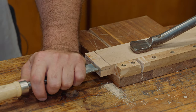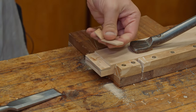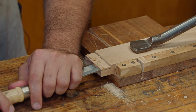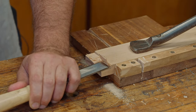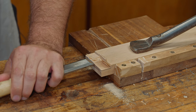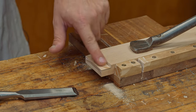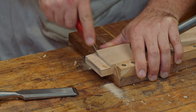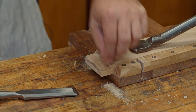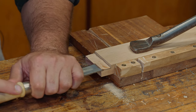We can see that it is splitting out quite straight. So we can come down and take out a little bit more. Now I'm going to go down and come in 1 or 2 millimetres just above that marking gauge line, and work across once again. Important thing is that we don't go below that baseline. I can see I haven't quite cut deep enough, so I'm just going to bring my marking knife and cut that wall down a little bit deeper before I get to this next process. Then we come in referencing the chisel to the gauge line.